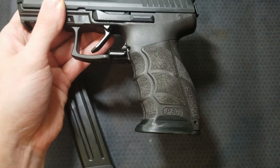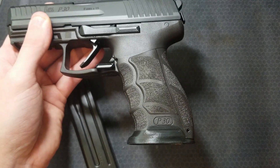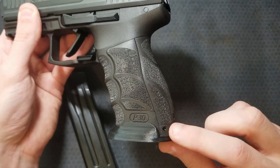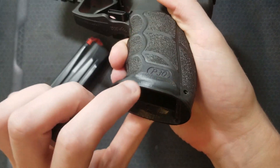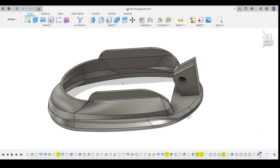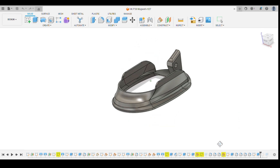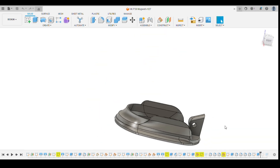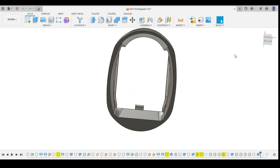Next up is the HK P30 magwell. I got lots of requests for this one on the video I posted on this firearm. I recommend printing it out of PETG — it has some thin features that need to be able to flex a little bit to conform to the grip. No hardware needed; it just secures on the front of the grip and the roll pin for the back strap holds it in the rear. This does work with factory magazine base pads but you do lose the ability to strip magazines out if you have this magwell on. I bought and tested the HK Parts machined aluminum magwell for this gun and the fit was so hilariously bad I designed my own out of spite. This thing has held up well over hundreds of rounds and will fit the P30 and P30L with any side plates and any back strap sizes, though the profile is meant to match the medium size back strap.